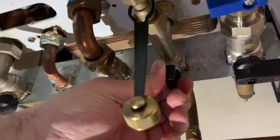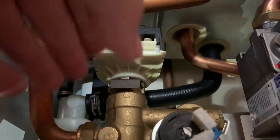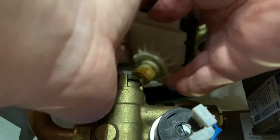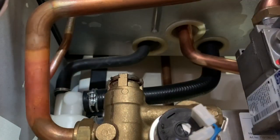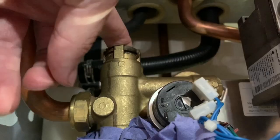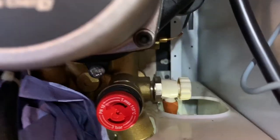We're then going to release the pressure from the tap and start to drain the boiler. The first thing I do is remove the securing pin holding the head in place, then remove the head so it exposes the pin below. Being careful not to spill water on the electrics — you may need some rag or a towel down there. Inside there's a little pin that you have to depress several times to release any water. We're then going to attach a small hose to the drain off cock inside the boiler and start to drain into a bucket below.